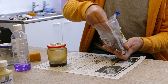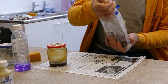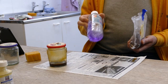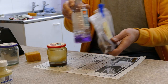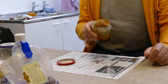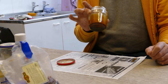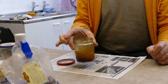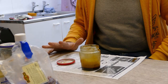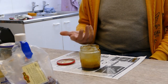I use these flakes of shellac — this particular one is lemon shellac. It is melted with methylated spirits; put the two together and you end up with liquid shellac. I make it about the same consistency as single cream, give or take. It's something you have to adjust to your own specifications and requirements — this consistency works particularly well for me.